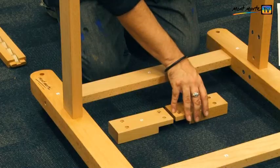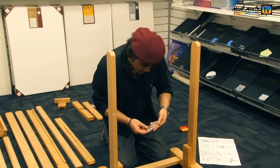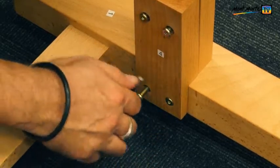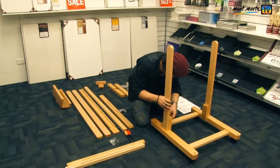In step three we fix the reinforcement blocks with the screws in bag D. When you tighten those screws, nip them all up, come back and tighten them fully. Do the other one like this too.